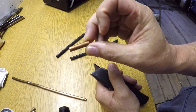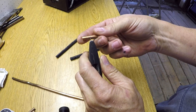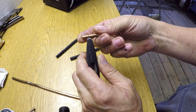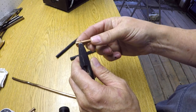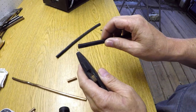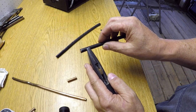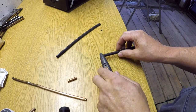I made my ends about one inch long. That way I have half an inch for the terminal where they'll be smashed flat and a hole drilled in it, and the other half inch will have the wire go up inside. So I'm going to peel these back — I'm not going to measure it, I'm just going to cut them back about a half of an inch, and I'm just using a box knife. Use whatever you've got.